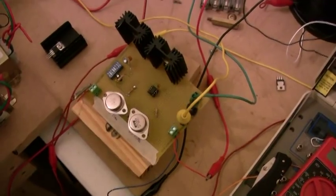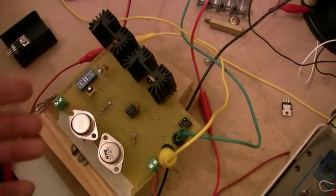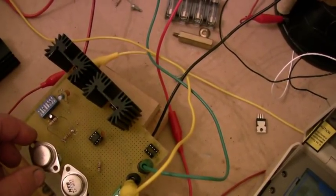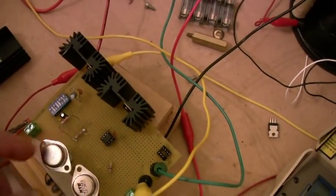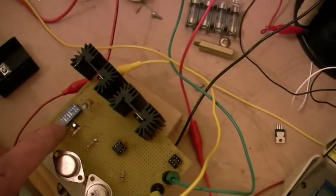Here we're just moving them around. That's where we go ahead and remove the 1K resistor and put in a 100 ohm resistor instead. What that allowed us to do is to go even lower on the duty cycle. So now our duty cycle — we can get it below 8%.